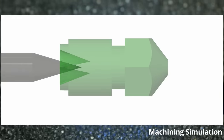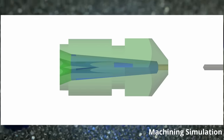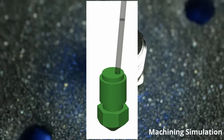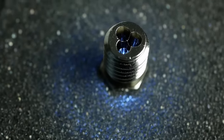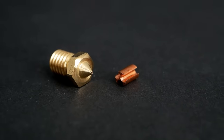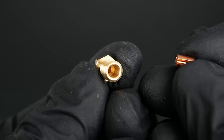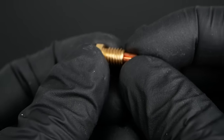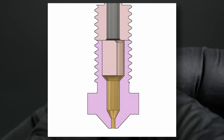From my previous investigation, I know that Bontech's design is made from one piece of metal into which they drill at an angle to form three channels and create the sharp blade that slices through the filament. The nozzle from AliExpress uses a much simpler approach: a regular nozzle with an increased internal diameter with a small piece of copper added that has three off-center bores chamfered on one side.